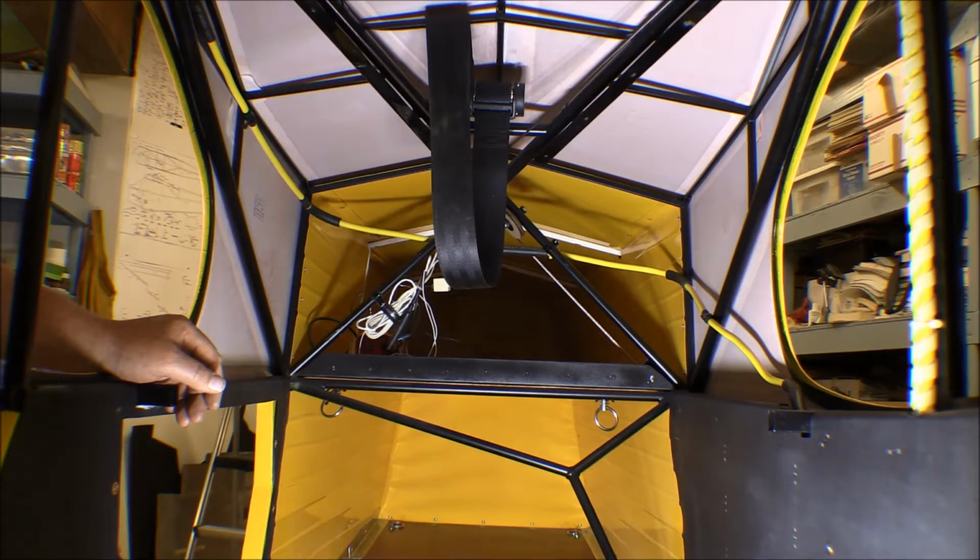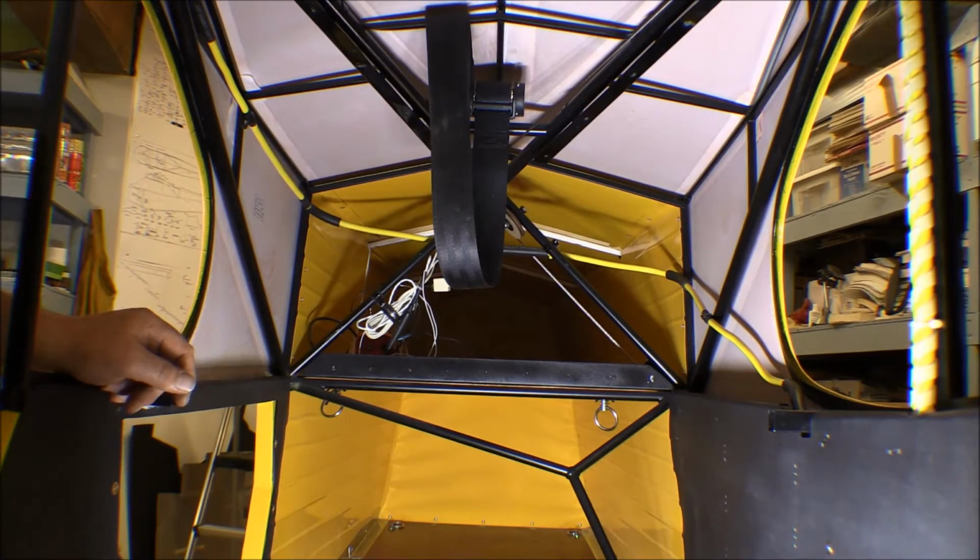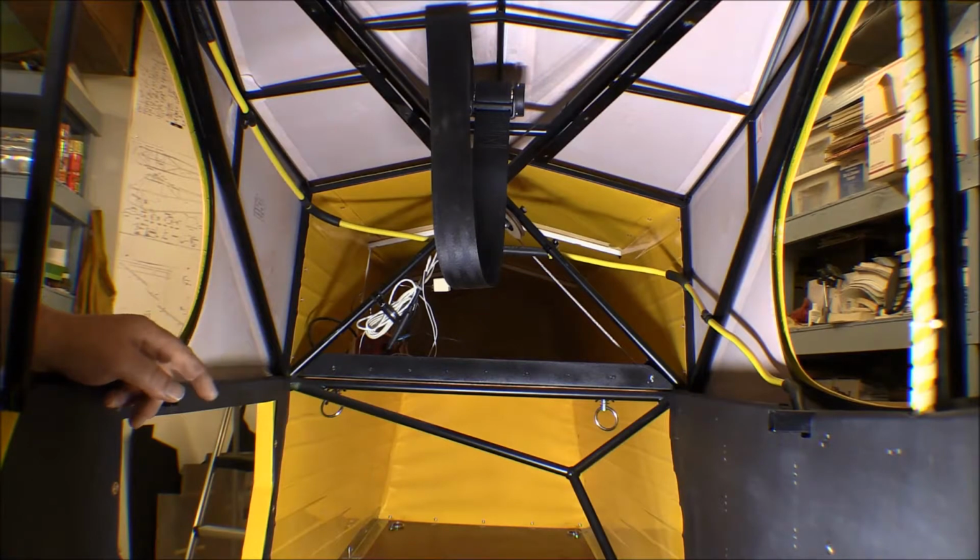to the point where those people were, just using the 406 megahertz, or EPIRB on a boat it's called. They were able to go right to the point, right to the beach, and pick those people up even after the boat sank. So these 406 megahertz ELTs, each one of them sends out its own discrete code, and those codes are registered. This one's registered to this airplane. So when it goes off, they know exactly which airplane it is that's going off.